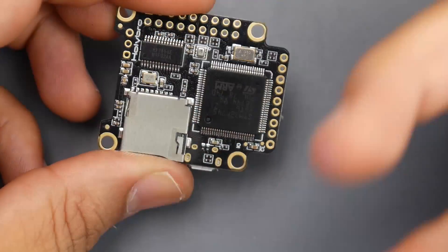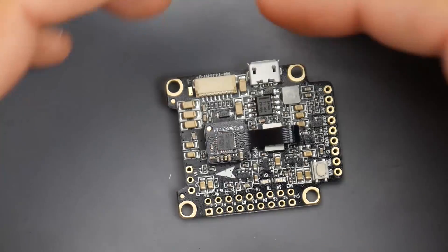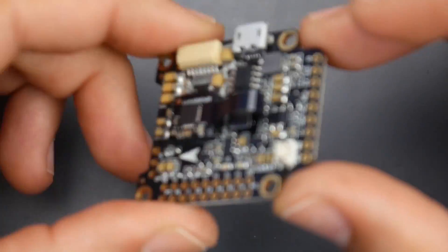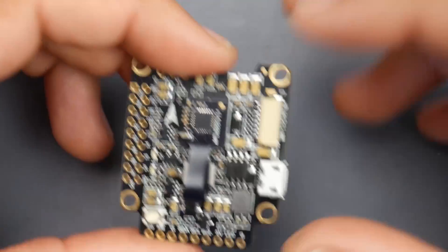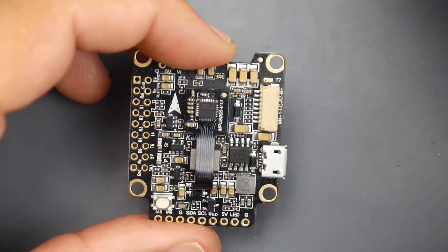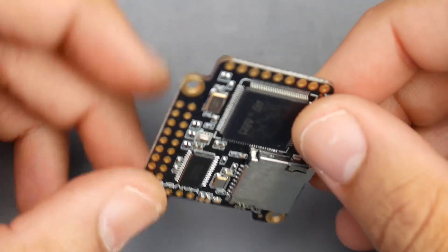Flipping it over we have the big F7, which has more memory - it's the big brother MCU and the latest and greatest. If Betaflight started using a new gyro, all it would take is a new firmware update and popping the old gyro off and putting the new one in. You can try out different gyros, which is a really nice feature. For the gyros, they've dropped down to an MPU 6000, which you're going to see a lot more in upcoming flight controllers, because no one's really using the ICM gyro anymore since Betaflight is capped at 8 kHz gyro loop frequency.